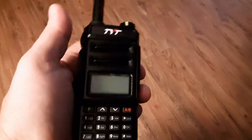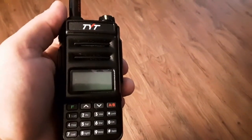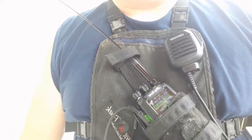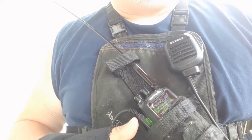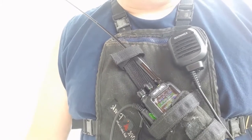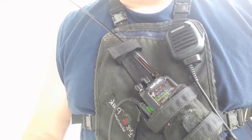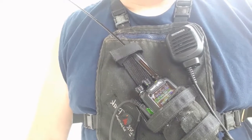Capacitive reactance, inductive reactance, loading coils — all of that changes. You basically have an image plane that changes the SWR. How the radio is mounted on my chest in a chest pack affects the SWR. If I hold the radio over my head, that affects SWR. If I put the antenna and radio up to my mouth to speak, that affects SWR too. A lot of the newer radios have all-plastic bodies with no metal connection where your hand can create a capacitive ground — that's why older radios had a metal case or metal belt loop so you could affect the ground image.